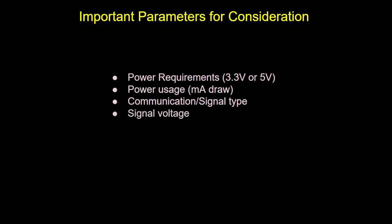What is the signal voltage? Remember that ESP boards can only accept 3.3 volts on their GPIO pins. Consider the environmental conditions for your project, since some sensors work better in certain environments. And finally, what is the cost versus the true need for your particular project?